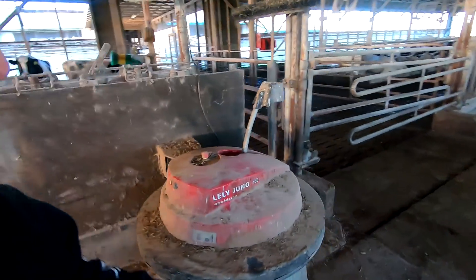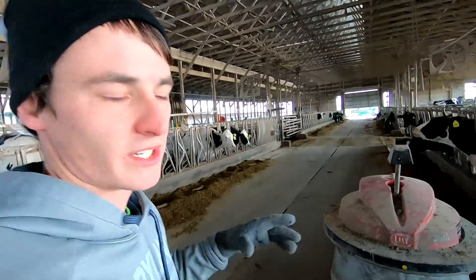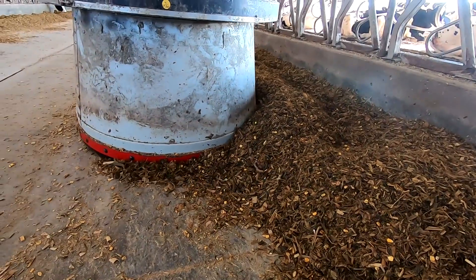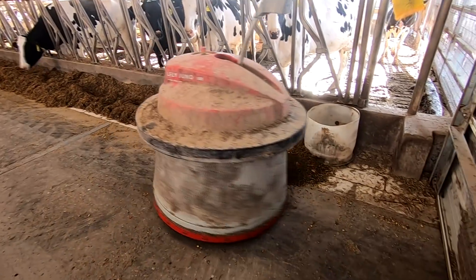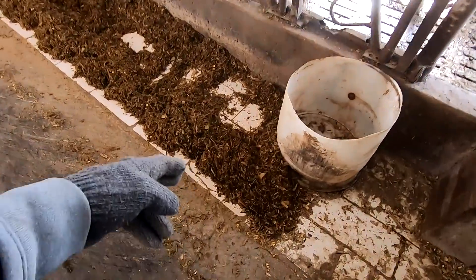We wanted to get it running right now but the batteries are dead because it was sitting off the charger for the last four days. It is the next day now — we got the robot charged up and it's running, and it's working! That cord was the issue; that's why it wasn't sensing those strips. Once I saw the old cord had that tear in it, I knew that was going to work. I think it'll do a lot better with traction when we get that sticky weather that makes the concrete slick. It's coming a few inches farther than it used to — it used to stop more like here, now it comes up about this far. There's a way in the settings to adjust the wheel diameter; we might have to change that. That'll be it for this video, guys — we'll see you later.